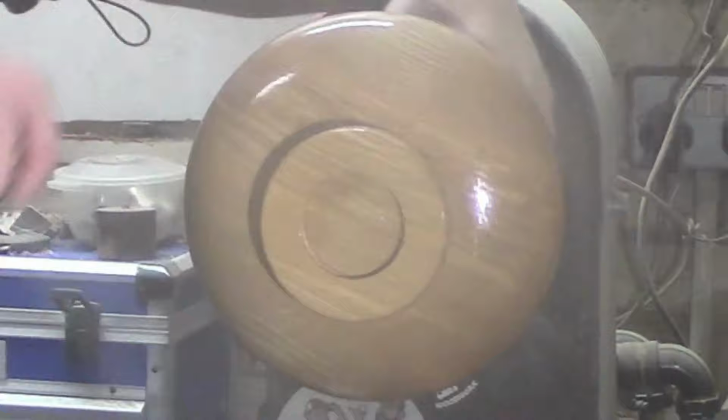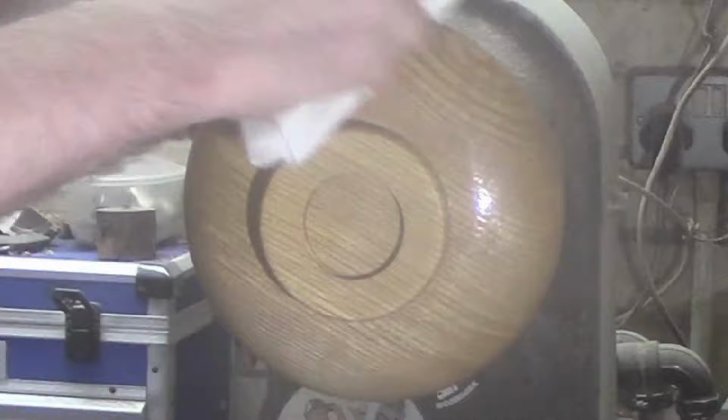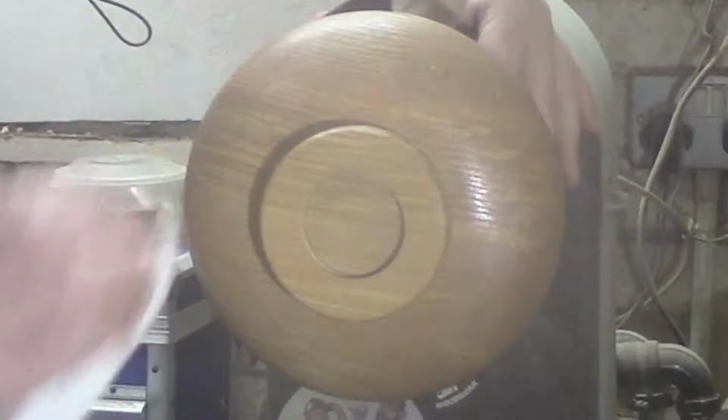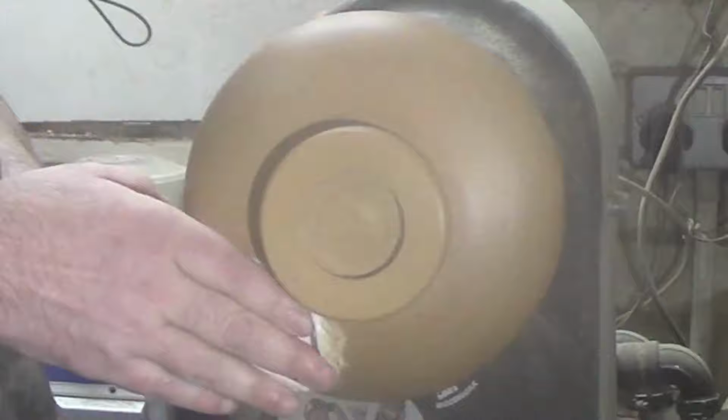And some Yorkshire Grit abrasive paste. You can get this from Northside Custom Crafts if you are in the USA, or Axminster if you are in the UK. Links down in the description. Buff it in until you get a clean paper towel, and you'll have the equivalent of around about 1,000 grit.